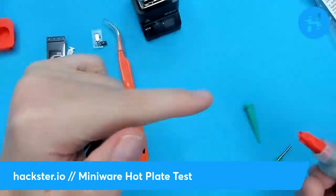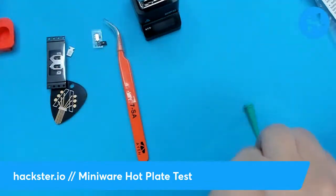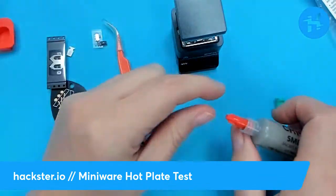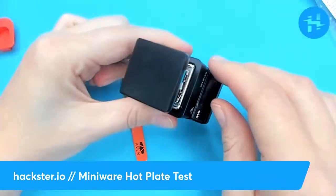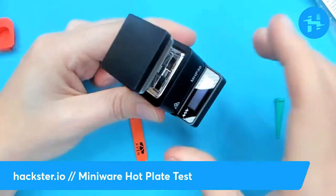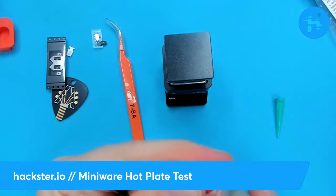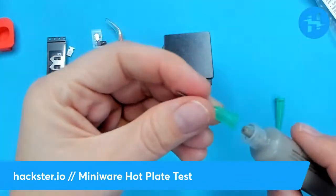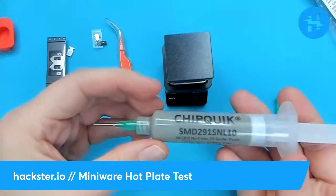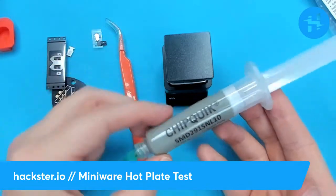Go in there fully! Okay — and then I'm pulling back slightly to relieve the pressure. It does say don't pull back too much, because the white stopper could come out completely. You can already see that when I pull it back, it's sort of disengaging from the solder paste in the tube. And then we take this off. My guess is it's probably going to spurt out a little bit because we just put a bunch of pressure on it. But I'm going to get ready with this dispenser needle, which is the type that I like. Oh, and the satisfying part — look at that. So nice. Cool. It's not spurting out — that's nice. And when I'm done with this, I'm going to put this in the fridge because it helps it stay good over time.